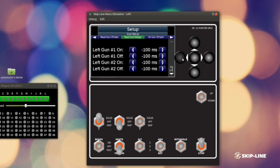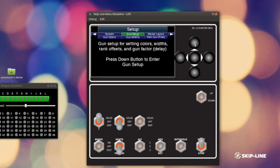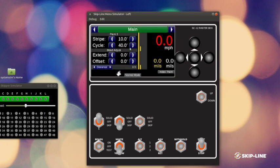So with these two settings, we've basically taken into account where material hits the ground relative to the carriage and how long it takes material to hit the ground. And this is a combination of the solenoid responsiveness, moving the plunger, and actual fall time. Now that we've got those things set up, we really should be somewhat close to lining up on a skip on both ends. So theoretically, beads would start and end fairly spot on with the skip.